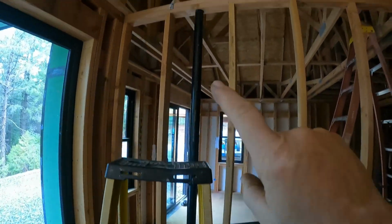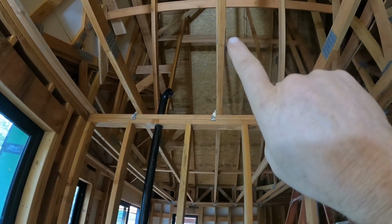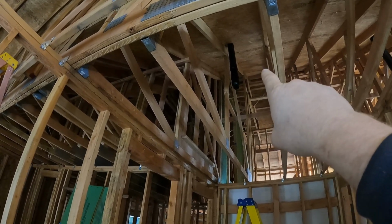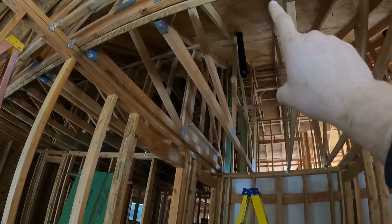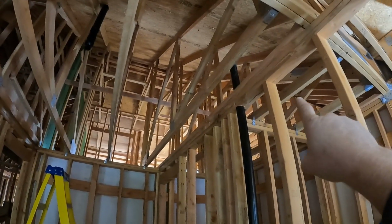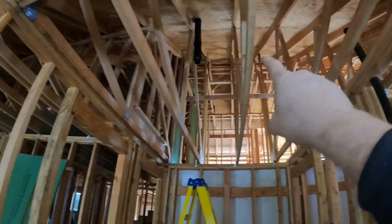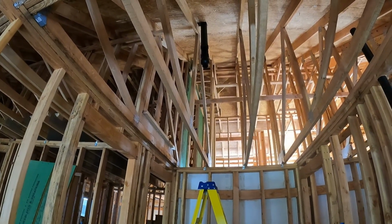All right, so this bathtub vent is going to 90 at the top. We're going to come out at a 45-degree angle. Then we'll have a 45-degree bend, and we're going to come across, and we're going to go up into that 2-inch there. That's coming out of the side of that 3 for the riser going up towards the big 4-inch stack. And then these two vents will tie together with a 2x2x2 Y and come across, and we'll tie it into the bottom. And once we get all that done, I'll bring you back and you can see what it looks like.